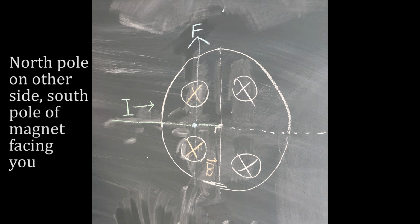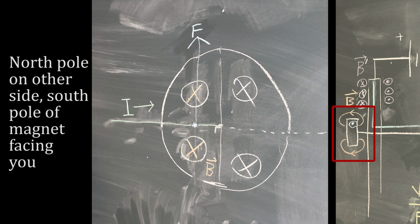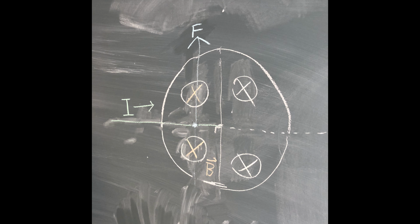This is the side view of the magnet, with a source of EMF in the left direction and a current flowing to the right. The field points outward from the north pole and then curves around to the south pole. Look at the diagram for more clarification. The field goes through the current near the bottom of the projectile where it touches the rails.